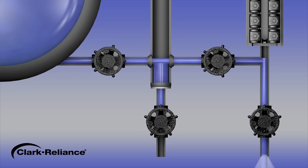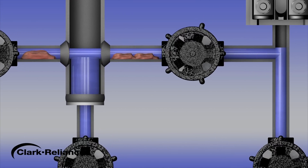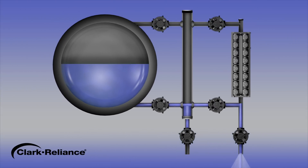But there is no assurance the water leg piping between the boiler drum and the level instrument has been flushed, because steam and water are both flowing from the outlet of the open drain. By following this procedure, the operator will ensure that steam and water both flow freely in this piping by testing them independently. The intent of this part of the procedure is to remove any debris or sediment from the water leg piping. While the risk of developing a blockage in the steam piping is very low, the risk for sediment buildup in the water piping is much greater over time. After following the blowdown procedure, the operator can be assured the steam and water connecting piping will be thoroughly flushed.